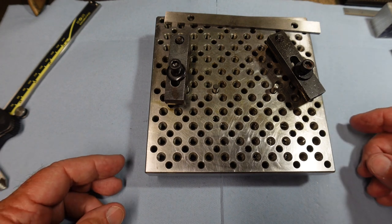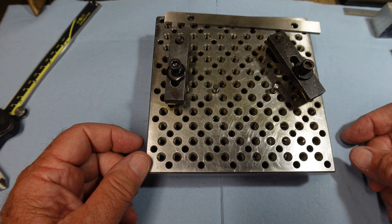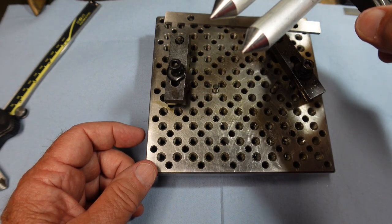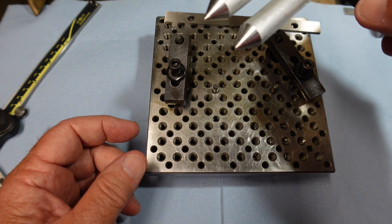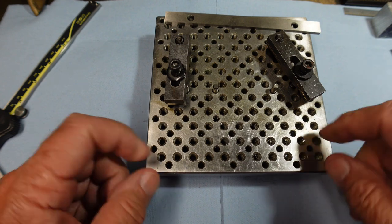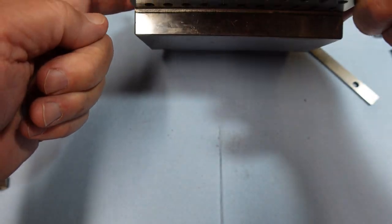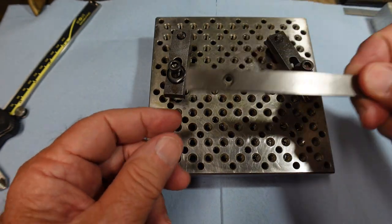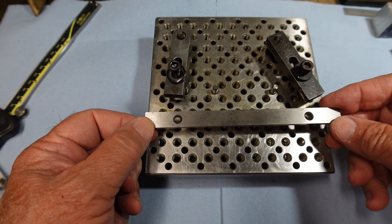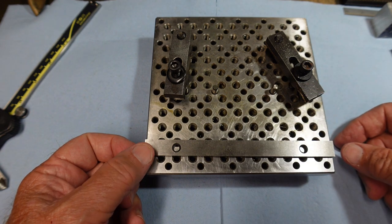To make the pins, I took a six-inch piece of five-eighths aluminum rod, put it in the lathe, and turned the points on the two pieces. Then I put it in the mill and cut the slots. After cutting the slots, I put it on this pallet — the pallet has dowels for alignment and can set right in the vice. I used a parallel to line up the slot so it was parallel with the pallet, then went ahead and did the set screws.